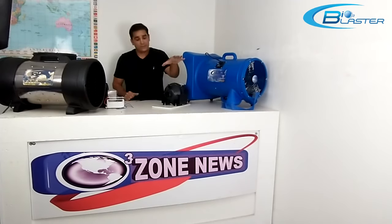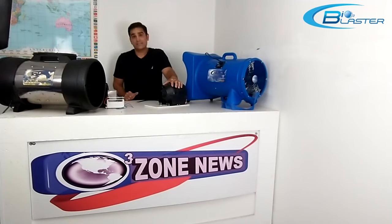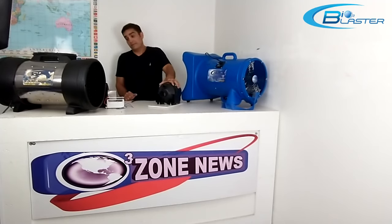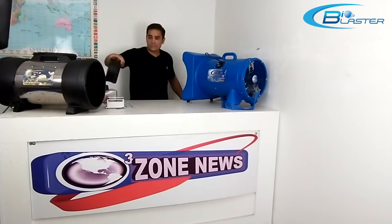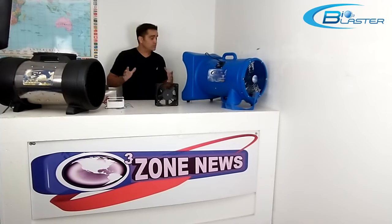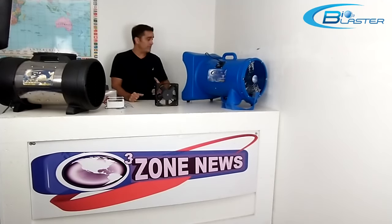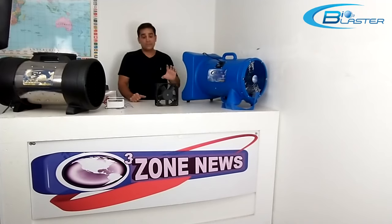Then there was a different problem. The spa blower company we used still makes these plastic housings in America, but they switched the inside guts from an American-made blower to Chinese. Unfortunately, the Chinese blowers just couldn't hang — instead of lasting for years in service, they started to go bad in months. So we replaced the spa blower with a really high-output sealed ball bearing blower. This is a 90,000-hour sealed ball bearing blower that moves a whopping 400 cubic feet of air per minute, making it five to six times the standard computer fan still used in other companies' ozone generators today.